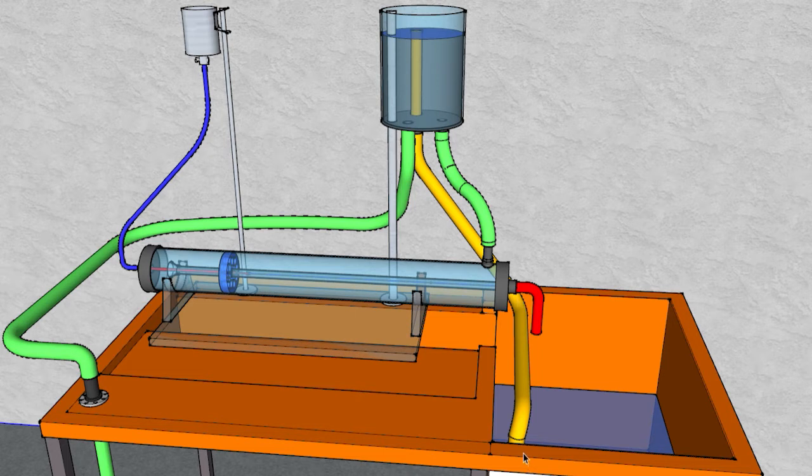The idea of the system is simple. The water flows from the pump through the green pipe directly into the head-stabilizing tank. Once it reaches the height of the yellow pipe, it will overflow down, keeping the head constant at that height. This stabilizes the water so it will not fluctuate from the motor. The green pipe represents the inflow into the system.